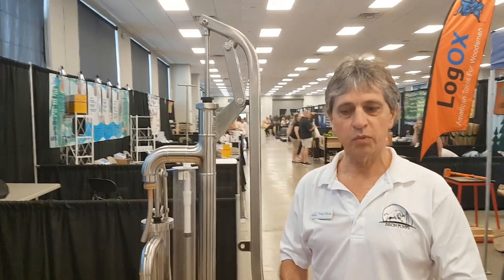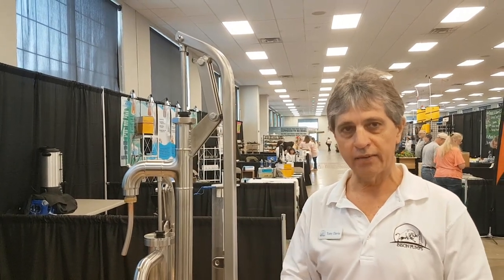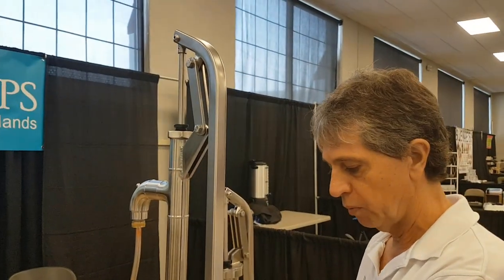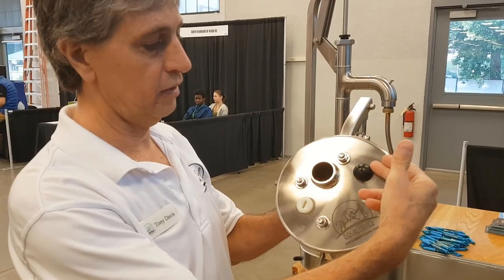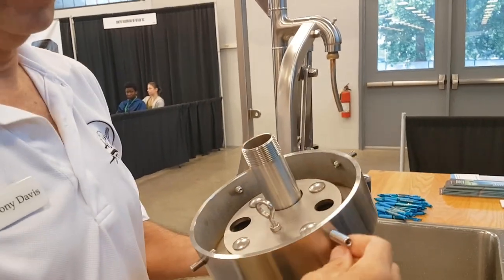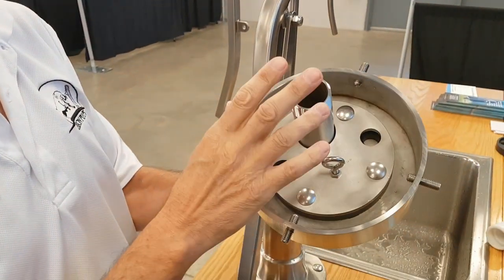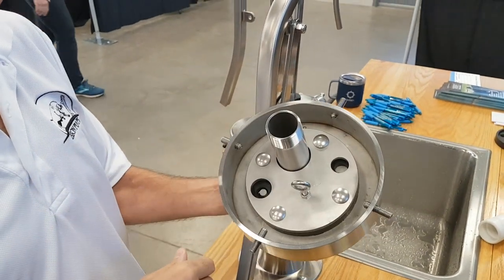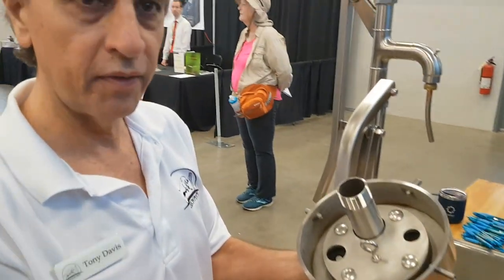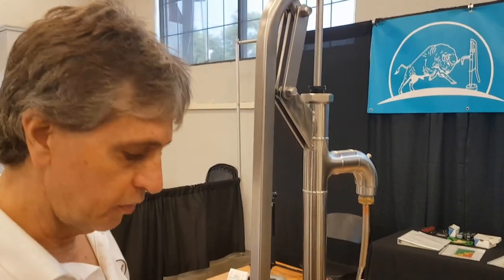This is our standard deep well pump. 'Deep well' means your static water level — the distance from ground to water surface — is greater than 25 feet, so you have to put a pump down into the water and lift it up. This is the standard pump head with our most common well adapter. Here is the filter, the bolts to tighten the bottom plate, your electric wire access, the set screws to tighten against your casing, the bottom plate that compresses your gasket, and the end of the pump where the first piece of PVC pipe would be attached.